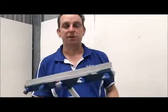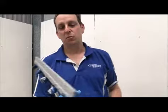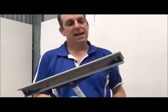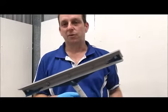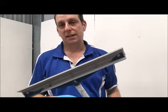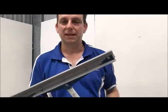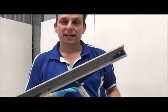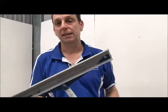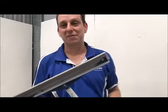So the verdict was, when I first started squeegeeing it out, I actually didn't like it. I felt it wasn't pulling it down far enough, and I was getting nervous about my coverage. And what I realized is the reason why I wasn't getting the coverage that I had worked out was that it was an undulating profile. This mezzanine was a sanded, sprinkled broadcast non-slip, so this squeegee was never going to touch down everywhere. It was always going to go down thicker than the 200 to 250 microns. So I actually didn't feel that comfortable about it.